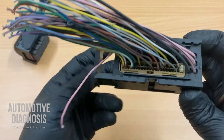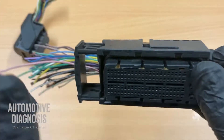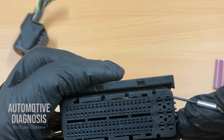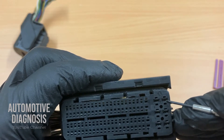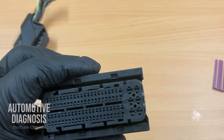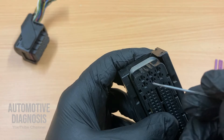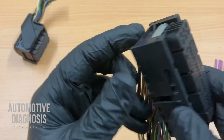If you check the pins, we have two different types: the big ones and the smaller ones. For the big ones — if I show you the other side — this is the pin. The big ones are actually the pins, but the small slots above and below are how you can get to the little tabs. For any of them, there are two little tabs holding the big pins in place. Any tool you use must be small enough to go in there without damaging the pin, the little tabs, or the connector body, because you are going to use it again.